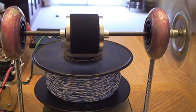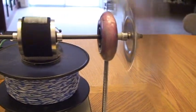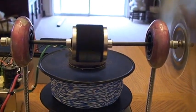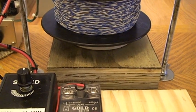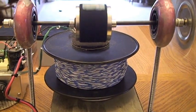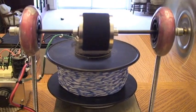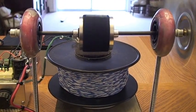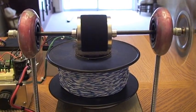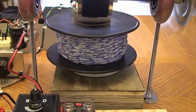This thing goes much faster when it's free-wheeling — like three times as fast. When you want to free-wheel it, the riser and wood block have to come out, and it sits on the base — that gives you maximum speed for a no-load condition. When you get the maximum speed for no-load and maximum speed for a loaded condition, you subtract the two when it comes to watt power. You need a wattmeter to do this. You'll find out it is more efficient when it's loaded on.